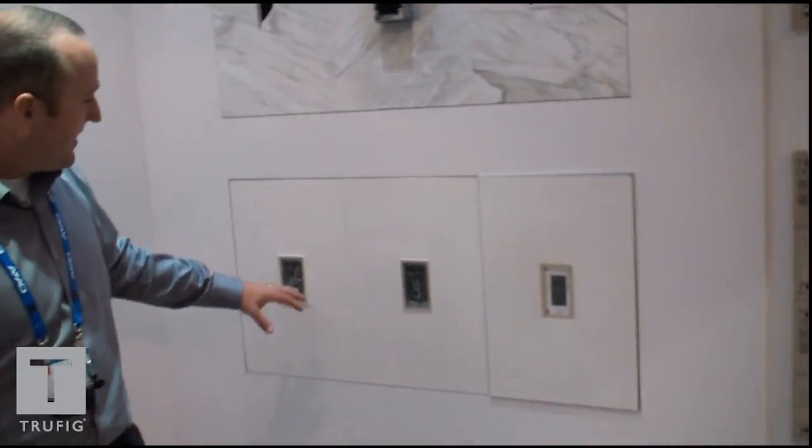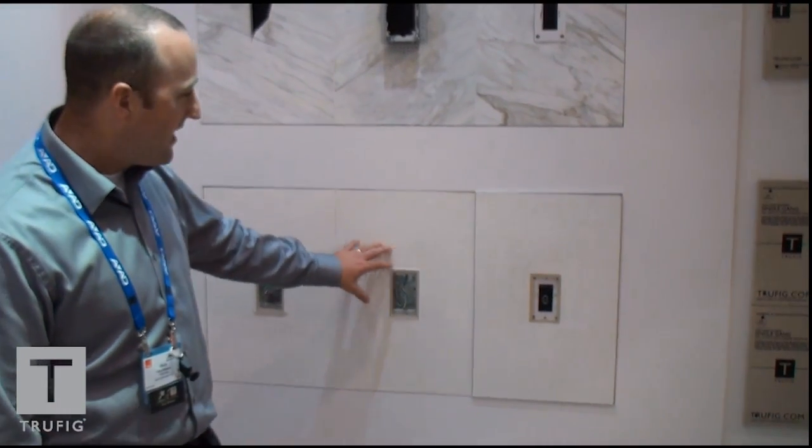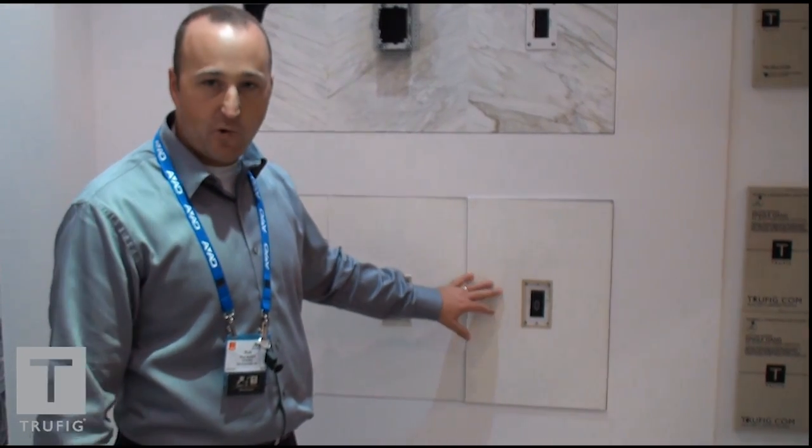Plaster is similar, and then they'll put a base coat on here, a sealing coat to get it ready for plaster, and then however thick the plaster is, they'll build it up to this mud dam right here and do up to about 1/4 inch of plaster.